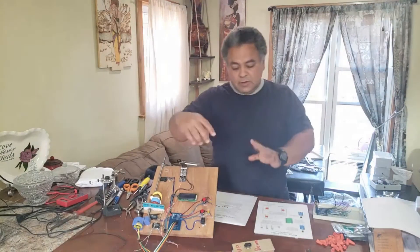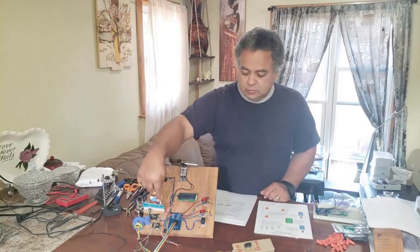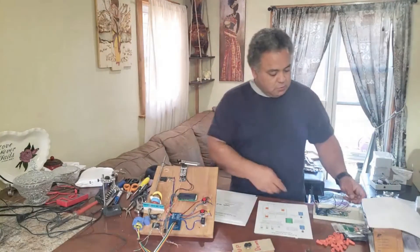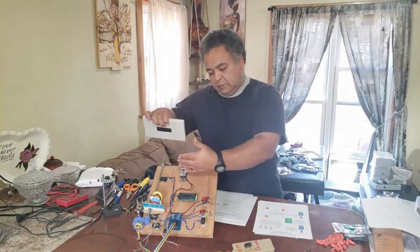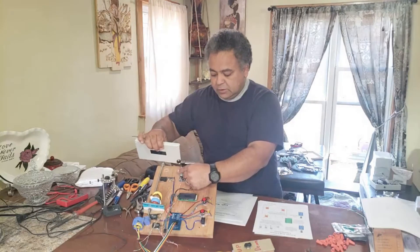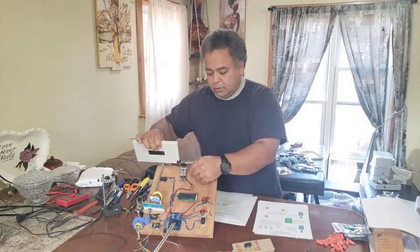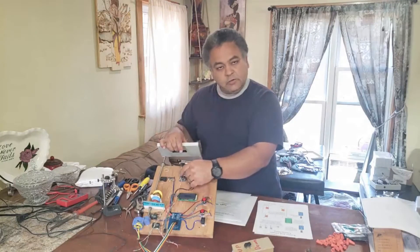Once the elevator is at your desired first floor position, you'll notice the backup switch is positioned below it. With your elevator floor in its correct position, slide the first floor switch until it touches the elevator. You'll hear a click letting you know the switch is activated. Mark where that switch needs to go, then raise your elevator and install the switch at that location.